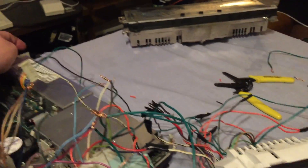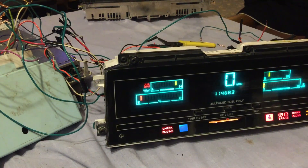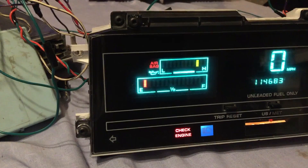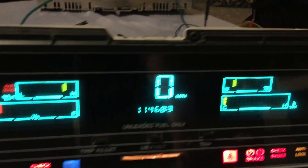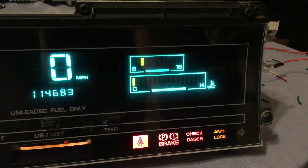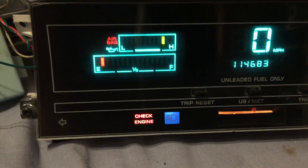"Your fuel is low." The electronic voice alert is working — it just notified us that our fuel is low. The system does believe that the fuel is low, although not empty currently. It sees that there is oil pressure, although a bit too much. It believes the voltage is a little bit low and that the coolant is currently cold. We've got our check gauges light on as a result of the low voltage, and the anti-lock light, parking brake light, seat belt light, check engine light — all that is wired up and functioning.